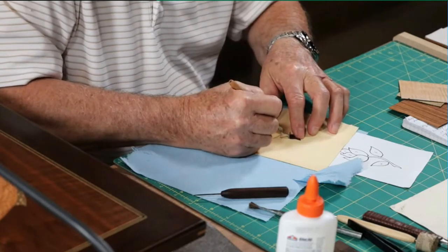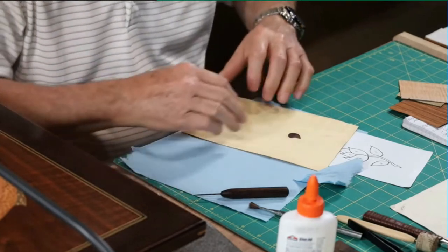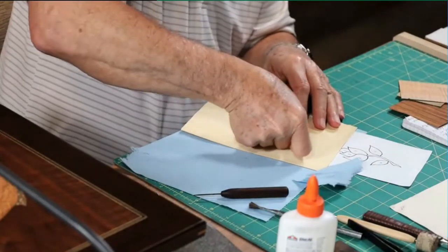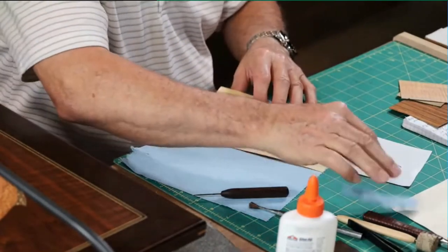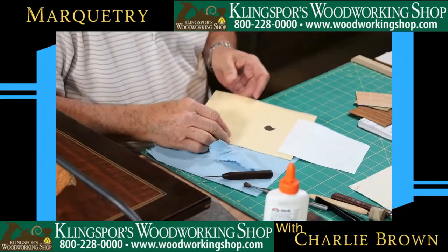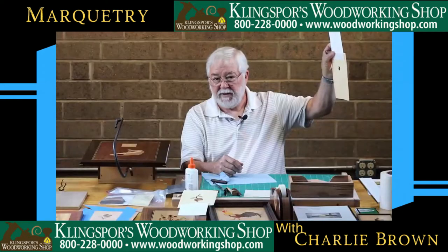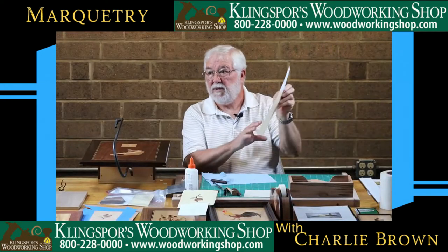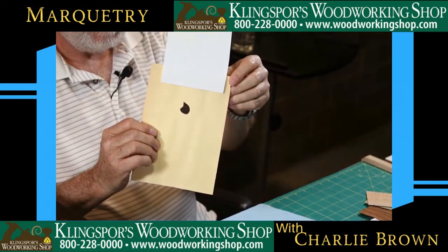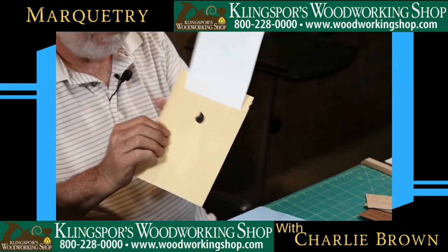Helps to have a little garbage can beside you here that I neglected to bring. All right, I put it in there, and I'm going to tape it in place. The tape's there just to hold it temporarily. Okay, and there's the piece. Now, I'm going to hold it up to the light here, but you see there is no kerf line there. I don't know if the camera will accommodate me here, but there's no kerf line. You can't see any daylight through there. And that's the beauty of the double bevel method.